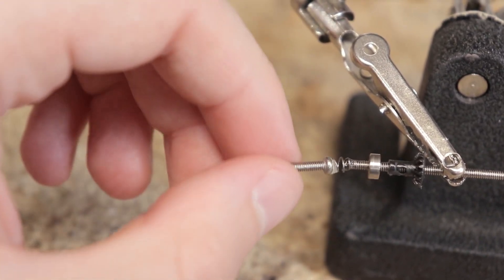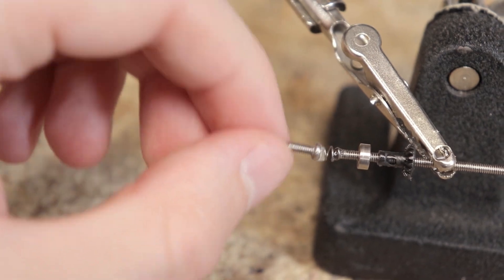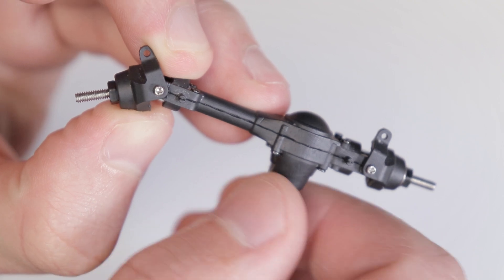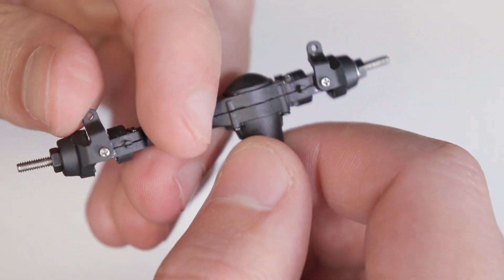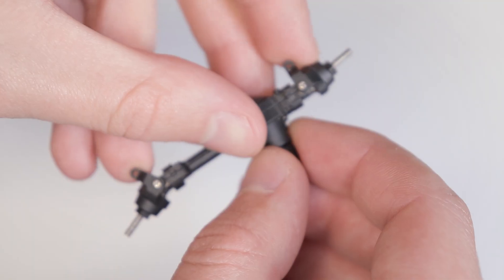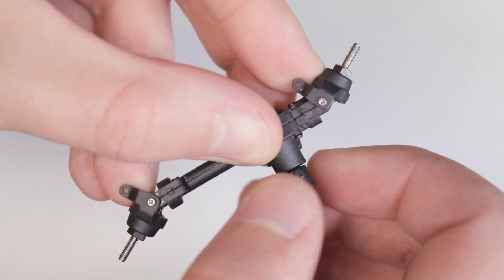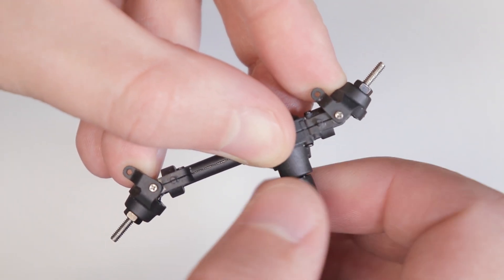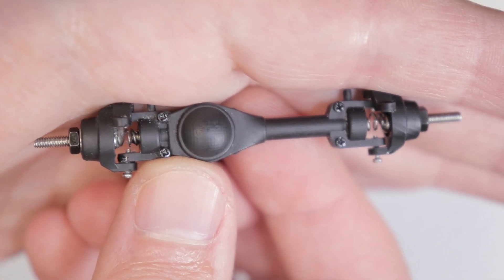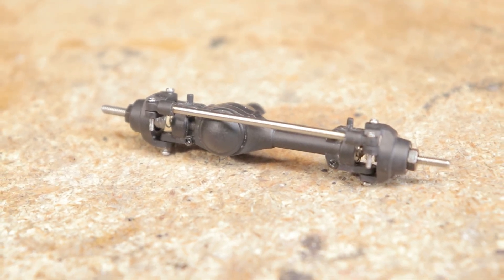You could call this a very basic DIY spring coupling. As you can see, the springs are able to transfer power as I spin the pinion gear — even as I steer the axle, power can still be transferred. I can actually get quite a bit of steering angle if I really want to push it to the limit, but I've snapped the springs on a few occasions pushing it to its absolute limit, so I'll just stick to a more reasonable steering angle here. You can see from that glue build-up I've had to re-glue the spring on a few occasions, which isn't exactly fun — but this is yet another 'wow, this actually works' moment here in the workshop.